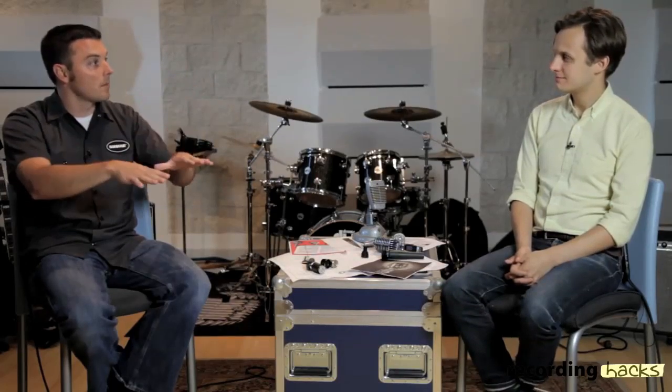Frequency response. There's a resonance frequency to the dynamic microphone coil and diaphragm assembly that we're going to want to basically damp down and make flatter than it is. The resonant frequency of a diaphragm on a 57 or 58 is actually pretty low, like in the 100 hertz area. That would mean there'd be a big bump in the response that we would want to tame. That's just the tuned or resonant mechanical frequency of the mylar.